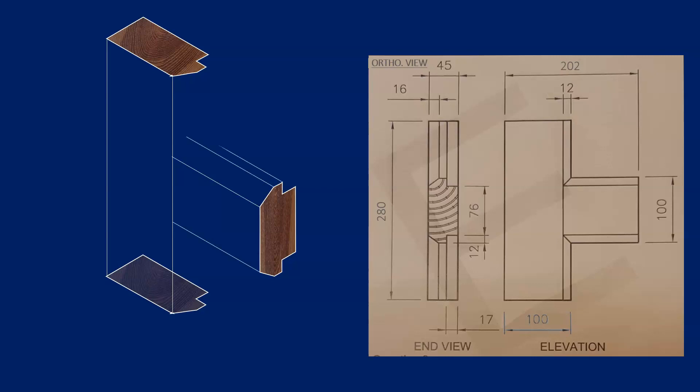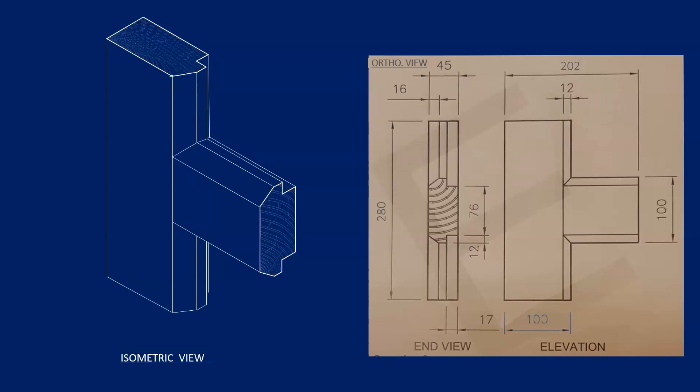As before, pull the lines on the nearest surface first — they form the joint line between the horizontal member and the vertical member. Pull the lines in both directions, keeping them faint initially until you find where the junctions are, then strengthen them in. After that, put in your two guidelines and print the title of that view.